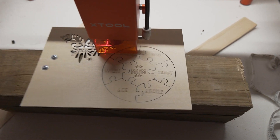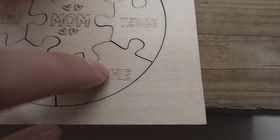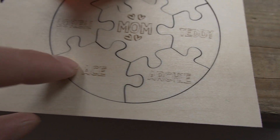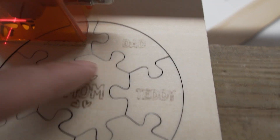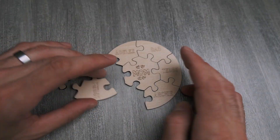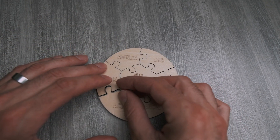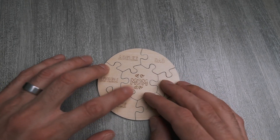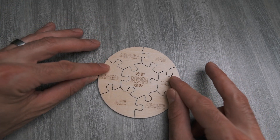We just finished — the cuts look great, but the font kind of screwed me up. The width of the lines I was trying to engrave were so small it confused the G-code. The 'Mom' text and the hearts came out pretty good, but the smaller scaled ones didn't come out great. All the pieces are fully cut though, which is awesome. Overall the pieces fit together really nicely — there's a little slop from the laser burning away the wood, but for what it is, it's an awesome gift. I'll probably trace over the letters with a marker and have my kids decorate each individual puzzle piece. Hopefully you found that helpful — links to everything are in the description below. Thanks for watching!